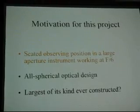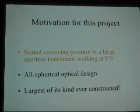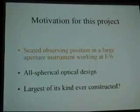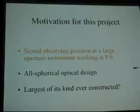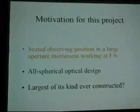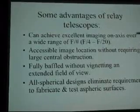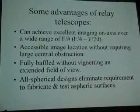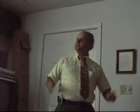I had an accident — it broke my hip on my other scope. The 32-inch in New Hampshire requires climbing a ladder; it's a Newtonian, and getting older, if you're out in the cold you want to observe from a warm room. I have a Newtonian at F-4, but this new design gives me F-6. It's an all-spherical optical design with six elements and eleven optical surfaces. It's the largest relay scope I've made. You can vary the design from F-4 to F-20; I ended up with F-6 because I thought it would be best for what I wanted. It doesn't have a large central obstruction and is fully baffled without vignetting. I didn't realize how important that was until I actually started using it — I can see more in Gloucester now than with my other scope, because it's fully baffled.